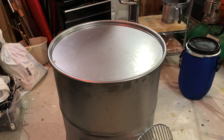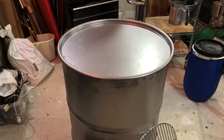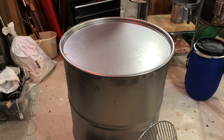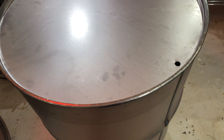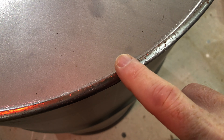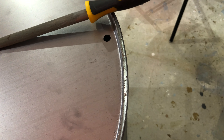I'm not going to do time-lapse because it's boring. I'll do a few stages showing you what I've drilled and where and why. So the next thing you'll see will be some action. Okay, turn it over — and that's my first hole for one foot. Around this edge is what I'm talking about — that is nasty. It's got a curl-over lip from the manufacturer and you've got to get yourself a tool to round it over. Once you've done that, I'd recommend running around with some emery paper as well to make sure that edge is friendly — a super sharp edge paint's not going to stick to it anyway.